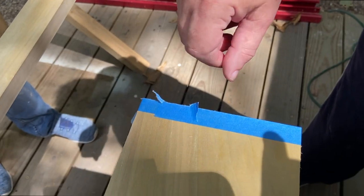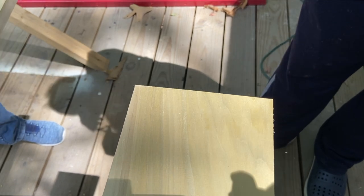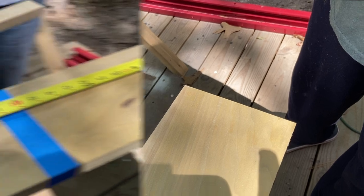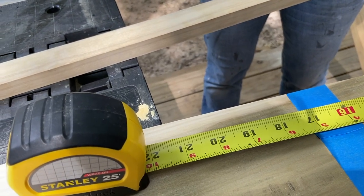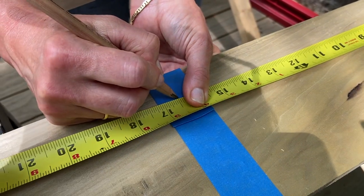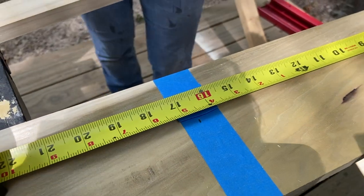You can see the difference — it's a much cleaner cut. It did a little on the back but comparatively it is much better. We didn't eliminate tear-out, we just improved it. We were cutting off this edge to make sure we have a clean edge for our project. Also, when you use the tape trick, put your marks for where you cut on the tape — not on the wood — because you won't see it after you tape it. In our case the measurement is 16 and a half inches for the main body.